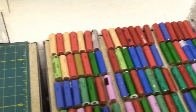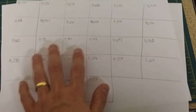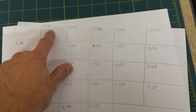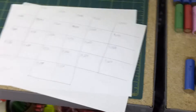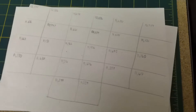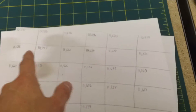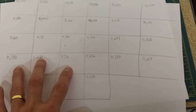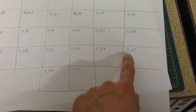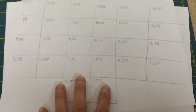I'll now go through the slow process of slightly changing the packs to make them even better. For the most part I don't need to worry about the middle ones — they're very even. It's just pulling some of the outliers up or down a little bit. The process is finding a low one, finding a high one, swapping a particular cell between the two, and trying to bring the numbers all in line. I'm not going to go too far with this — I just want to get it roughly right.